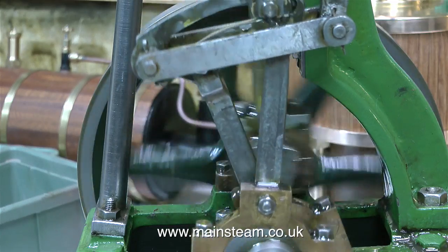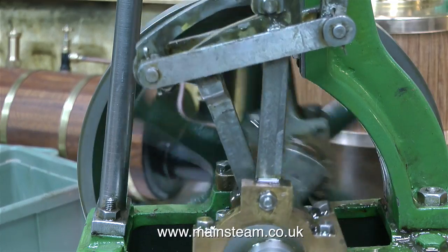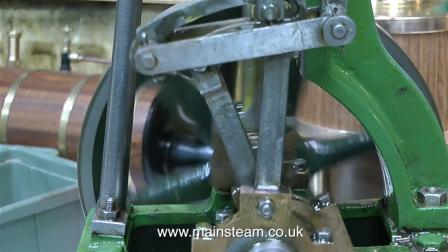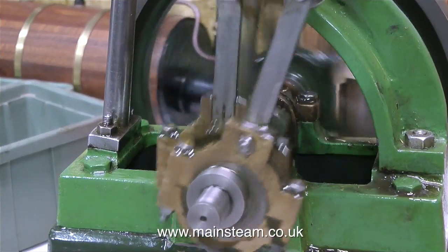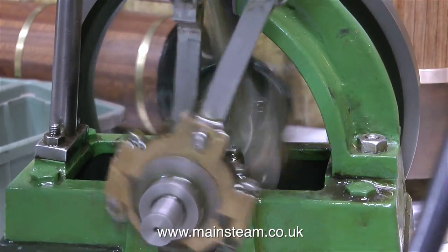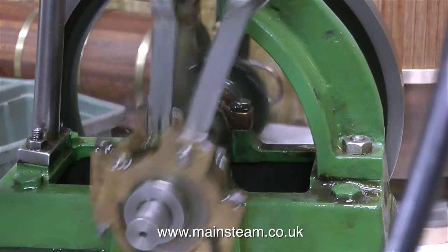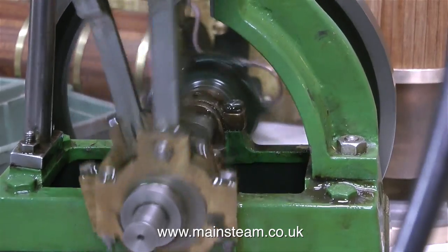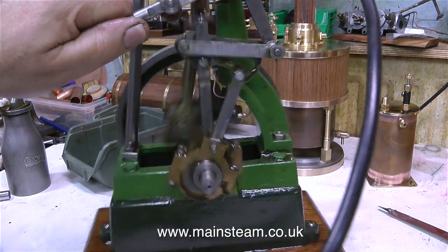Three and a half hours. I'll just move the valve a little bit more this way, then a little bit more the other way, and I'll just turn the eccentric anti-clockwise, then a 30th of an inch in a clockwise direction. And so it goes on — it really is good fun, but it's worth it in the end. There's still quite a lot more to do, but this engine is a different class. Once I've tightened down the main bearings it should be very smooth — then I need to make some exhaust pipes, thoroughly test it, make some gaskets and put it all back together. You'll notice I'm quickly reversing the engine and putting it back into forward gear. Thanks for watching and I hope you found it useful.